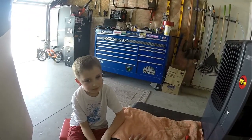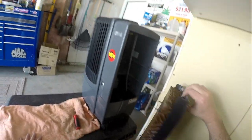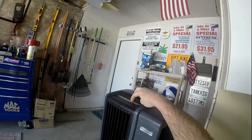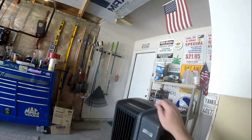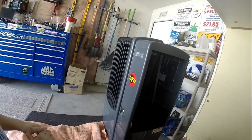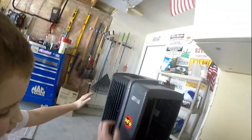So this is called an evaporative cooler. Some people call it a swamp cooler. The reason why they call it an evaporative cooler is because there's a water curtain that drips water. I want to show the water curtain. We're going to show the water curtain in action. That's the fan. The fan is sucking the air to blow it out this side. The water is evaporated a little bit into the air, and it cools the air and spits it out here nice and cool. That's why they call it an evaporative cooler.